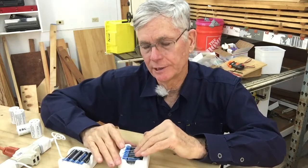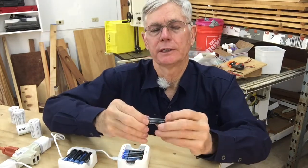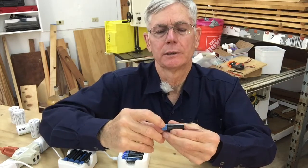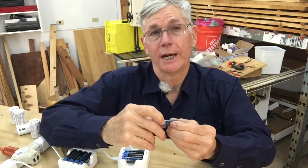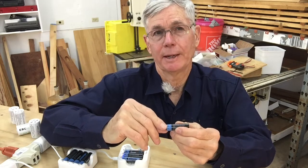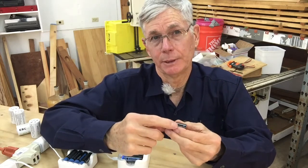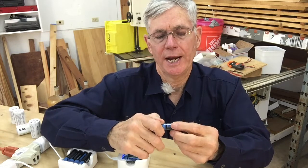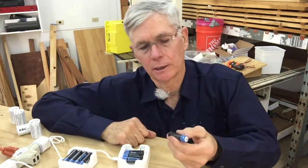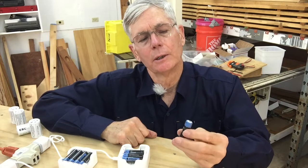What's peculiar about lithium rechargeable batteries is that they stay at one and a half volts the whole time they're in use. The way they do that is the major part is a lithium-ion battery that runs at 3.7 volts, and then up at the top is a little step-down transformer that takes that 3.7 volts and drops it down to 1.5 volts. So the whole time it's running, that little block of chips in there will make it output one and a half volts until it quits.